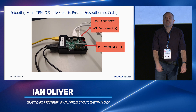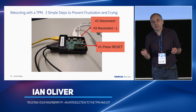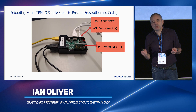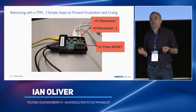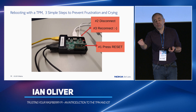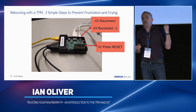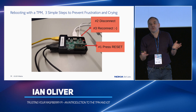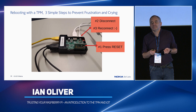If you reboot a Raspberry Pi — and this will haunt you many times as it did us — every time we rebooted the thing, the PCRs would be wrong. Until we realized that on x86 machines, when you reboot, the TPM and CPU are actually powered off. On the Raspberry Pi, the GPIO pins — so the power lines to the GPIO pins — are permanently on, connected to the power supply. So when you reboot your Pi, the TPM actually isn't restarted at all. Hence, if we need to reboot the Pi, we press the reset button, pull the power cable out, push it back in, and it comes up like a fresh device. We were presenting in Nice, France, and had a nice demo around the attestation server. To demonstrate rebooting, we would call up our student in Helsinki who would go into the office at 3 o'clock in the morning, reset all the Pis, and sit around all day waiting for the order to reboot. Good students — we gave him biscuits and food and water.